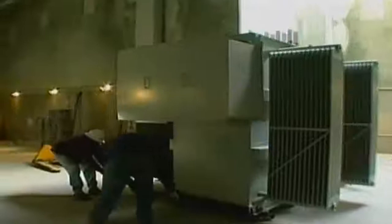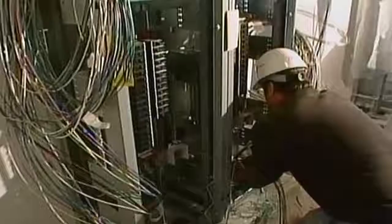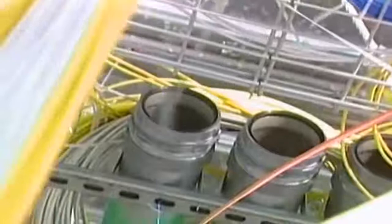Underground pipes bring in very high voltage cable at 34,500 volts into large transformers, which transform that high voltage into something people can actually use — 480 volts. Power then travels from the transformer to a breaker station; in a home it can be a small breaker box, with wires running through metal conduits to outlets where the consumer can plug in.